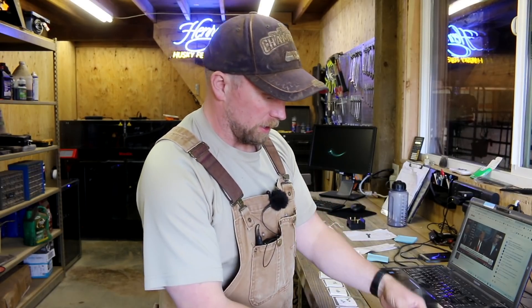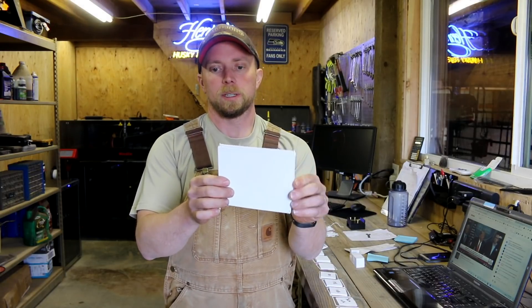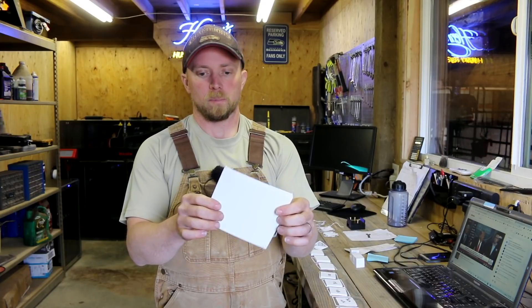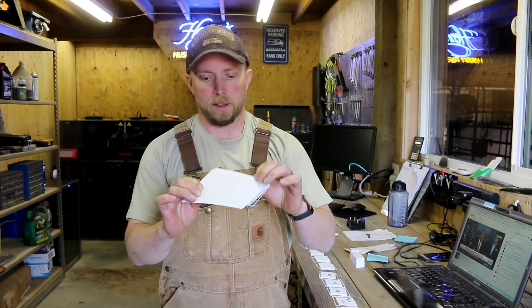We did another test here. This one had various things on it that told me whether they were successful or not. This is the back panel of a grow wall — grow walls are twenty-three inches in width. This is about seven inches in width, so it's twenty-five percent scale, about six inches there. What I was looking for is how the surface that connects to the print bed actually came out — and it came out great, came out perfect, way better than what we did before. It's a single layer print. The rest of this, which looks kind of messy, is a scale problem — it's too small and we couldn't get it with the nozzle size we're using here, and the thickness didn't have enough to adhere to. So it failed there, which is a good lesson learned.